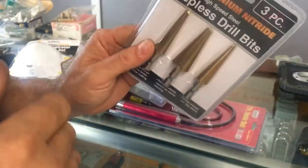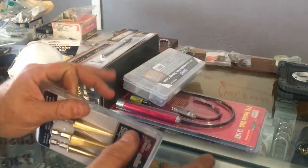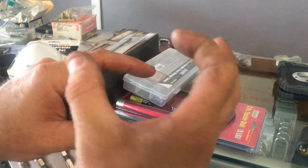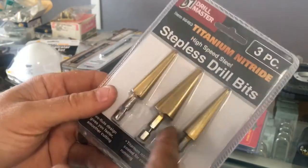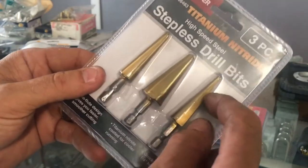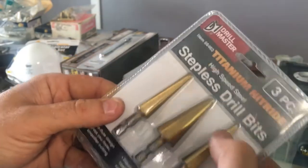Now, going back to my Trilogy video the other day, you saw me trying to fix the through bolt holes. It's very, very common when you're switching out hardware to find off-center through bolt holes, like 1/8 inch off, or too close to the edge of the 2 1/8 inch hole. So invariably you have to re-drill those holes and it's kind of a pain in the ass. So I usually use step bits for that, but sometimes I don't really like having to go through the notches of it. There is a step bit that's got further steps, thin steps and then thicker steps. And one of my bits has the thicker steps.